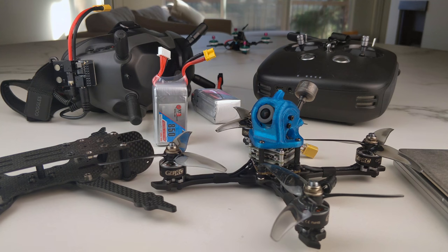Having lower voltage and higher capacity tends to give you more flight time, though obviously a little bit slower. But these things are already so fast you're usually not going 130 miles per hour all the time anyway. There's a lot of things coming in this category and it's going to be really interesting moving forward. For this quad, I would actually recommend a 1,000 or 1,100 milliamp 3S — I think it's a better fit than 4S of any capacity. A 4S 650 milliamp is the absolute smallest I would recommend on 4S; 850 milliamp 4S is better. You can even run a 1,600 or 1,800 milliamp 4S and it will still perform fantastically well. Take care, floss your teeth, hope this was helpful.